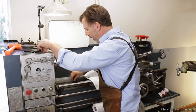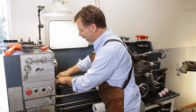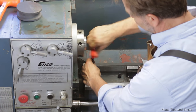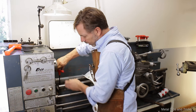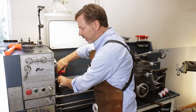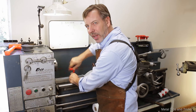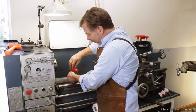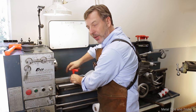I'm going to put the screws in now. Tightening these screws down, in my opinion, is just like tightening down a head on an engine — you don't want to torque one down and then go torque the rest, you want to work it in place. I didn't put any sort of oil or anti-seize materials in there because I don't know how flat this is going to sit. Based on how much oil was in there when I took it off, I think a lot will work its way in — it'll work through these bolts and also suck in through capillary action.